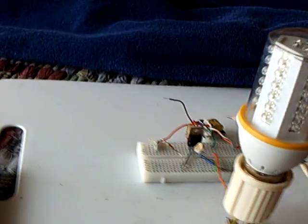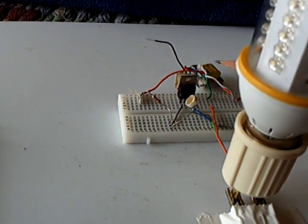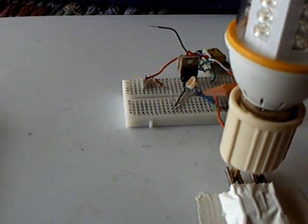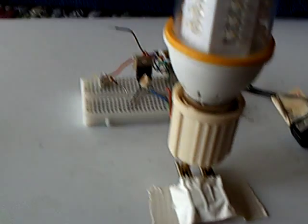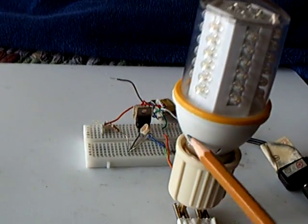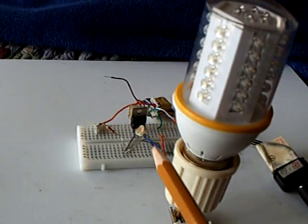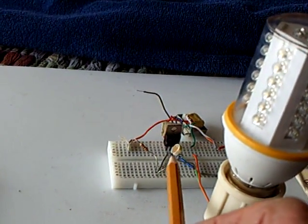I did get this little audio transformer — you can buy them at Radio Shack, they're two or three dollars. I'm using a TIP-31 here with a 10K resistor on the base, and the photo cell goes between the collector and the emitter on the circuit. This is just the LED bulb. Not all bulbs have the same kind of circuit inside them — some of the bulbs work and some don't work with this circuit very well. The circuit inside the AC bulb has something to do with why this circuit works.